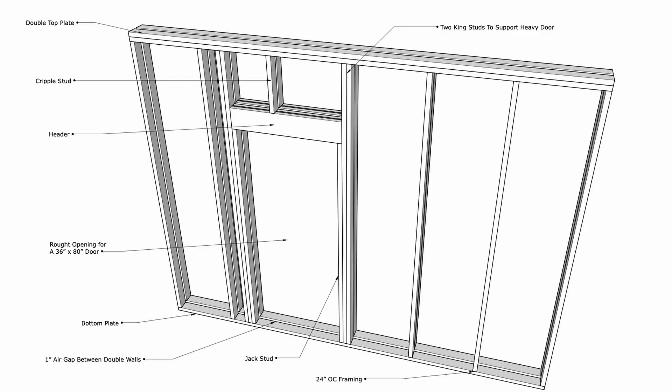Beyond the 24 inches versus 16 inches on center, there's one key difference here, and that is having two king studs. The king studs are going to be the studs that go from floor to ceiling surrounding our door opening. You'll notice that we've got two of those king studs in this diagram, and then you have your jack studs or inner studs, which support the inside of the door, and then you have your header. The really big difference here is making sure that you add support to this heavy door — these doors are going to weigh at least 140 pounds after we're done with them, so they need support and some bracing.